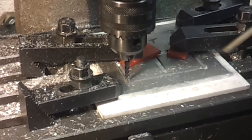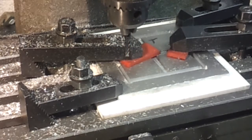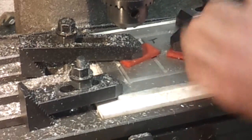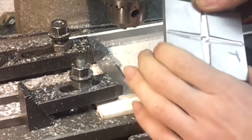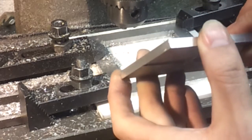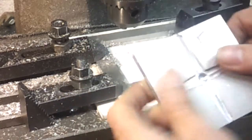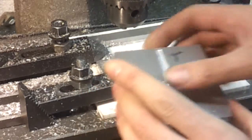That was a very slight finishing pass with a 3 degree taper cutter. With a bit of a look it should measure up as per the schematic. I can feel a very slight taper on the sides, which is good — if you catch it in the light you can perhaps just see there's a very slight taper on these sides, which will help me get it out of the mould. Apart from drilling a couple of holes on the back — I've marked it up so I know which side to do them on — that's that plate done.